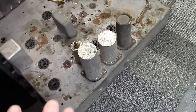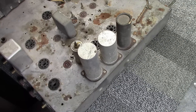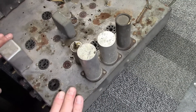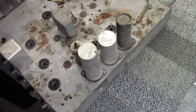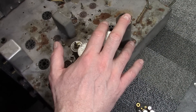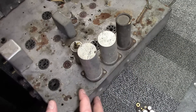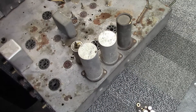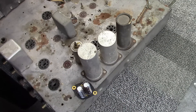This is a chassis I'm really excited about using these on — the Motorola seven-inch electrostatic set, TS4 and later TS18 series. These are series-strung sets with a floating chassis and no power transformer. There are three electrolytic cans, all of them isolated — all perfect opportunities to use these boards. I've restored a lot of these; they're a pain. I've tried cutting cans at the base, unmounting and restuffing them, terminal strips — all tedious and time-consuming. With these boards, we just drill out the rivets, disconnect the wires, pop in three boards, hook the wires back up, and done.